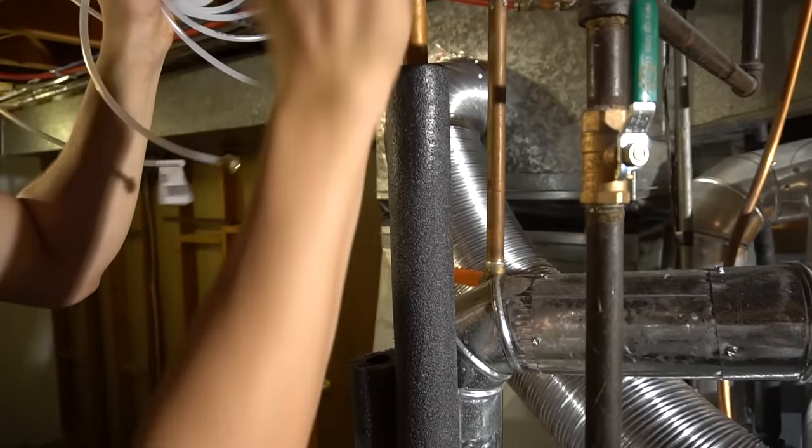Okay, so we screwed the transformer in. That's in there snug. Sometimes you get lucky and there's a neutral wire nut here and then a hot wire nut, so the black and white. This time, I'm not quite as lucky. I could put the black in here, but the neutral I'll stick through here, and I'll have to tie it into probably this wire nut right here.